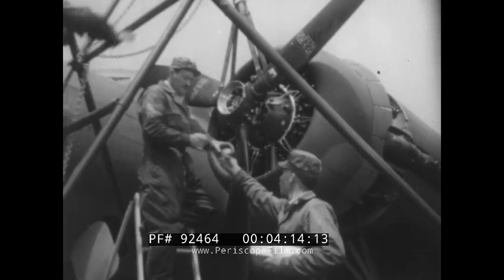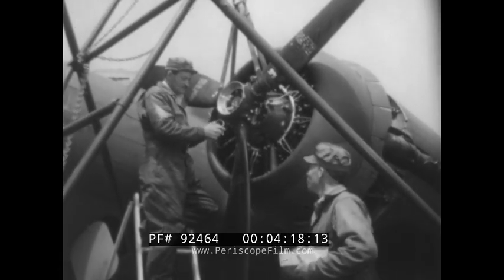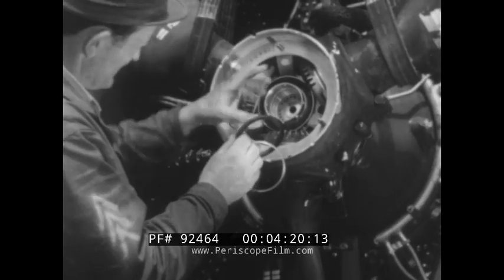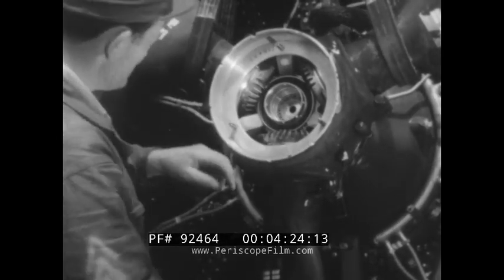Packing rings — these three rings are the first necessity around the shaft to prevent oil leakage. The first ring is flat. The second is a fiber with a deep V-shaped groove on the front, into which fits the third ring made of metal and also grooved. When it's installed, it spreads, widening the fiber ring to form a tight seal and keep the oil where it belongs.